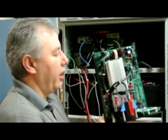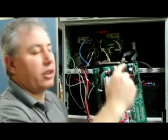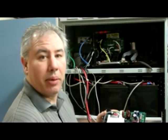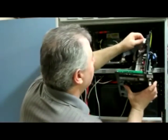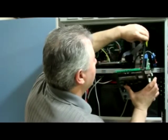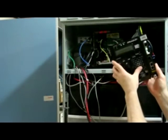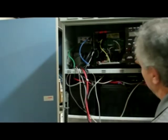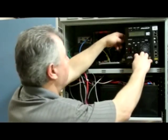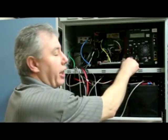This inverter has had the wires rerouted around the end of the heat sink. The end of the heat sink is what is causing the damage to the wires and causing the inverters to short. After the wires in the inverter have been rerouted and re-tie wrapped in these areas, reattach the ribbon cable and verify it's properly latched. The unit is to be lined up in the two guides — holding the ribbon cable, reinsert the unit. Reattach the two captive screws.